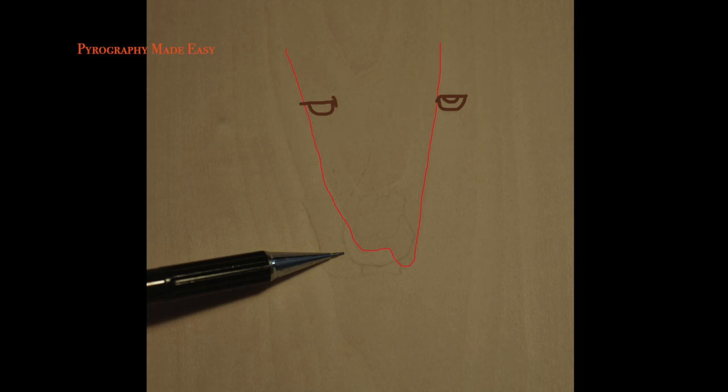This will probably make it very difficult to keep the eyes the same color. The second problem is that the grain runs through the nose. The nose is part of the focal point, so this will create a distracting line. If I rotate the board, the problem grain area inverts and moves to the right. Now all of the facial features are to the left of the problem grain area.